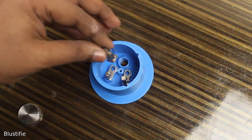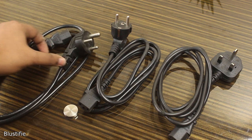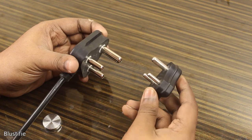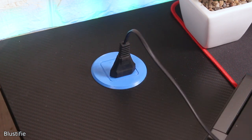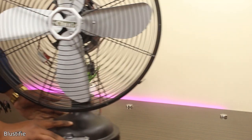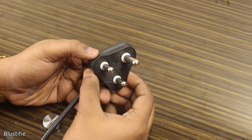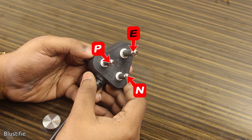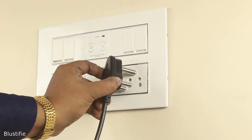I will make my own. So without further ado, let's start with the build. First of all, we have to determine what kind of plug we are going to use. As I am in India, we commonly use D-type plugs, 3-pin configuration — phase, neutral and earth. Sometimes we use C-type plugs for low power demanding applications such as smartphone chargers, low power adapters and fans. With bigger loads like motors, heaters, ovens, we use D-type plugs but much heavier and bigger, generally rated for 16A, with different plug dimensions.